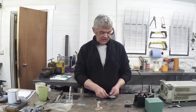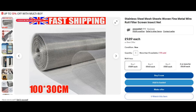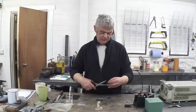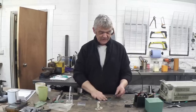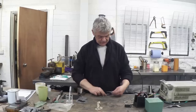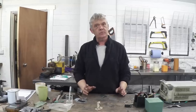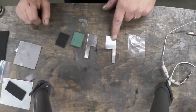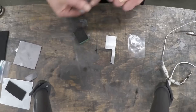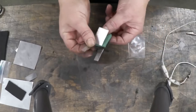The only other thing we need is some form of current collector. I'm a great fan of this stuff which is graphite foil, but a bit of stainless steel will do just as well. If you have some stainless steel mesh kicking around, like fly screen, cut a little bit of that off to make the other side — this is your other side current collector. Carbon goes on top, then graphite foil or stainless steel goes on that, and then you flip the whole thing over and your zinc goes on the back.